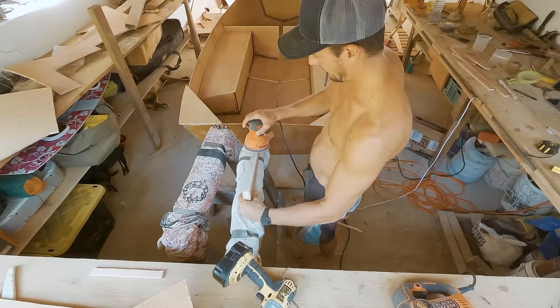For the dagger board and rudder, I followed the plans to get the proper dimensions. Both are made of three layers of plywood cut and glued together to make a thicker, stiffer plank. Once I cut all the panels out, I glued them together and used small wood screws to squish the layers together until the epoxy cured, then removed the screws to get two planks ready to be shaped. To shape the dagger board and rudder into foils, I used a grinder and an orbital sander — though I would recommend an electric planer if you have one, as it would save a lot of time. This shaping process takes a long time and needs to be done gradually, using the different layers of ply as visual guides to ensure the foils are shaped evenly.